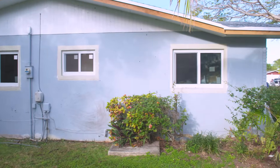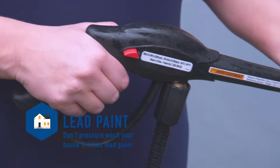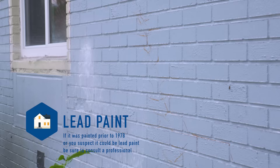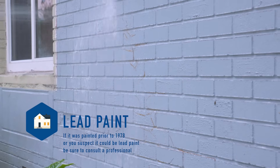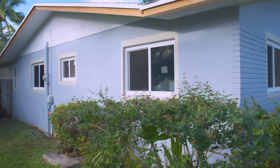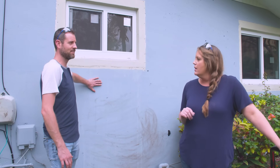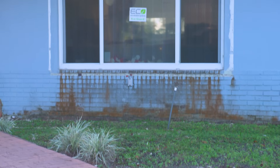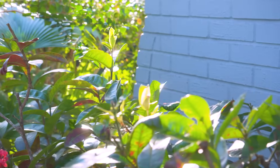This house is in the middle of a renovation, with some unpainted surfaces and missing trim, but luckily we're not dealing with any lead paint. Don't pressure wash your house if it's painted with lead paint, as this can be very hazardous. If your house was painted prior to 1978 or you suspect lead paint, let a professional do an inspection. It's really important to know what type of house material you're dealing with, as it impacts how you pressure wash, how much pressure to use, and the tips you use. This house has a block foundation, wood at the top, brick out front, and vinyl windows — and all of those are safe for pressure washing.